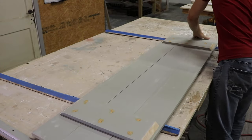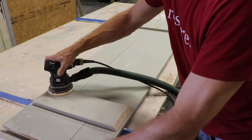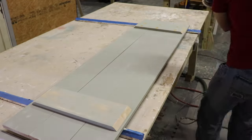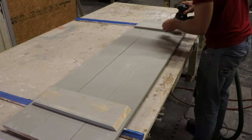After the wood filler had time to dry, I came back and sanded everything with 80 grit sandpaper. Looking back, I probably should have used 120 because this pre-primed cedar is super smooth, and after painting, I had some sanding marks show up. So next time I'll remember to use 120 grit.